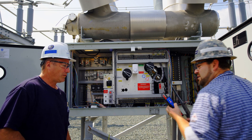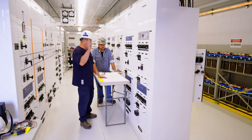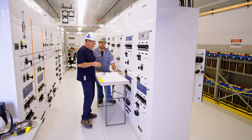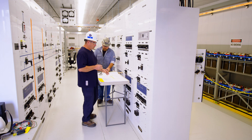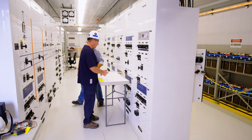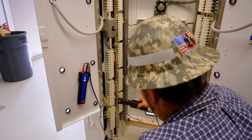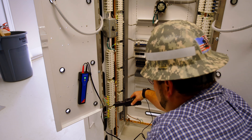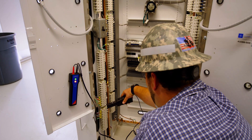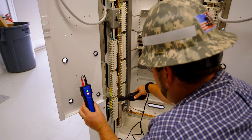We'll go inside and check the wiring inside the control house. Derek is going to go in the back of the panel with his probe and make sure he has it at the first point of entry from the CT from the outside. Derek, can you go to panel A1? On H1, you should have it — and we are reading polarity. You shouldn't have it on A1, H2 — we're reading nothing on H2, or H3. All right, H3 we have nothing as well.